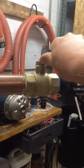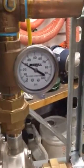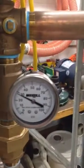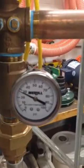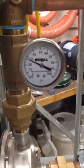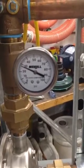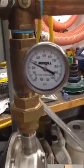I'll choke back this to near deadhead and let's see what happens. It's slowing down. You can hear the VFD is operating at much lower hertz. I'm going to actually close the discharge valve. Eventually it should reach that 25 PSI and it should go to sleep. You can hear the VFD slowing down. It seems to be working just fine.